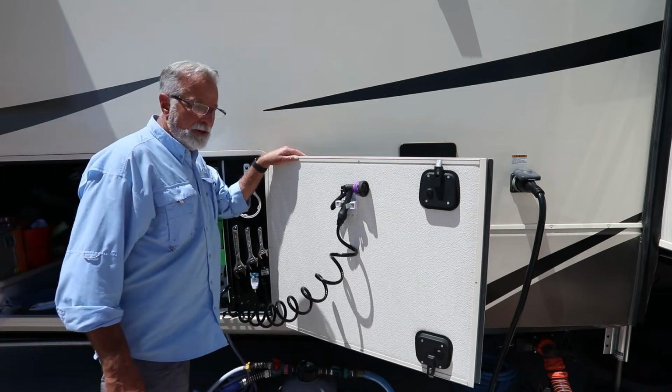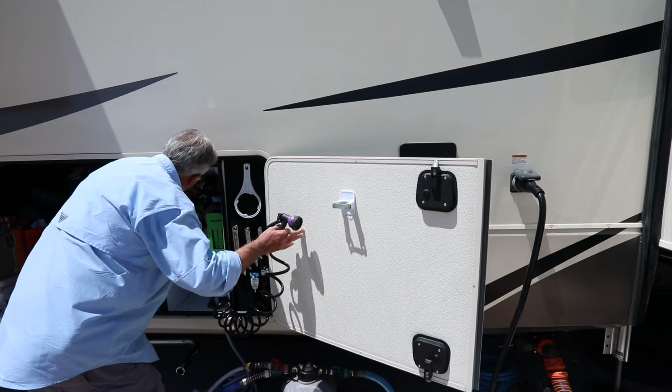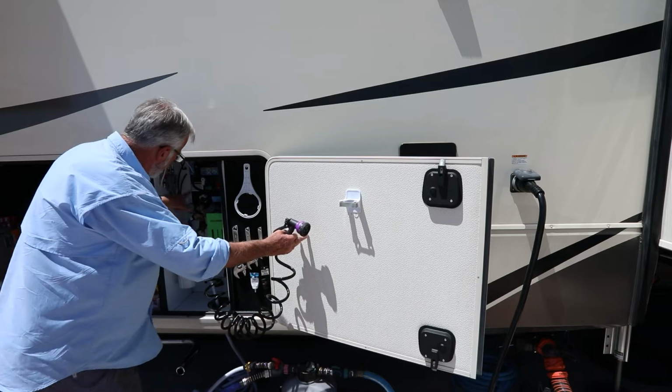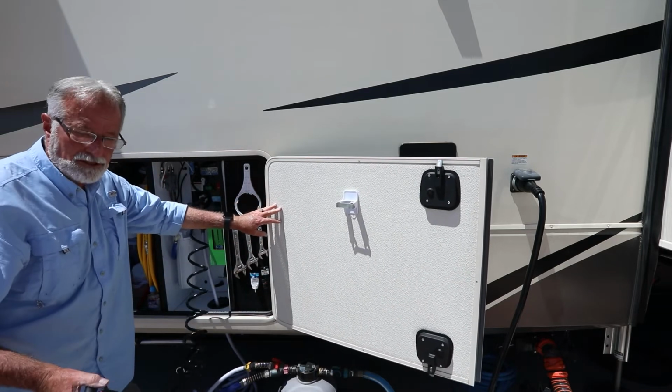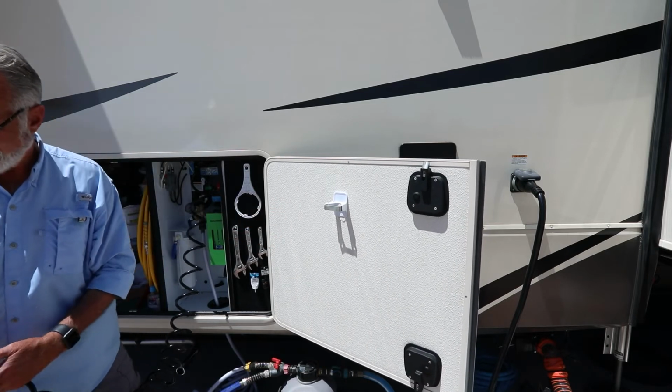One of the nice things about having a Nautilus system is we have an outside wash. So I'm going to turn on the hot water. I've got my Nautilus set to be able to still use water, and I'm going to go ahead and dump the heat, so you'll have a 50% solution for the descaling process. Of course, I picked a 100-degree day to start, but I'd really like to get it done before we leave.